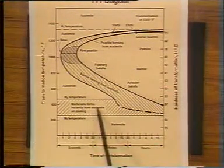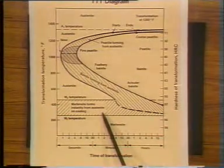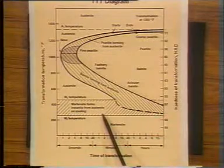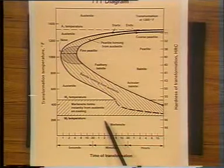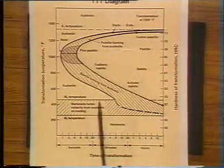A material cooled instantly from austenite into the lower region might not be completely transformed. For example, a razor blade stored in the deep freeze would drop to a lower temperature, transforming all of the retained austenite into martensite, resulting in a harder blade and more shaves. This is called the time-temperature transformation curve, or TTT diagram, and it is essentially what governs what we do with steel.